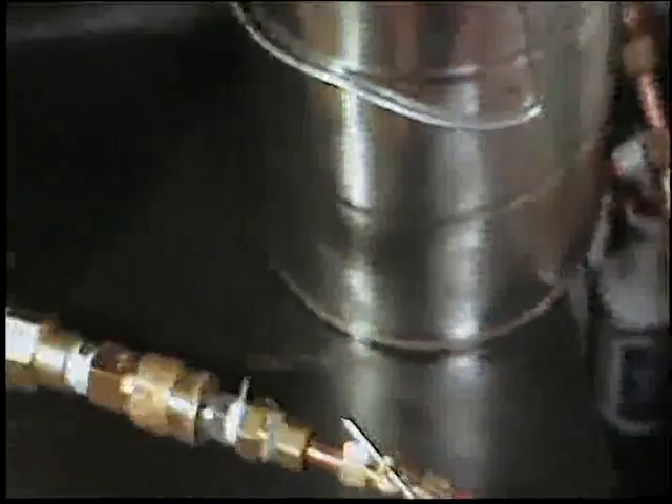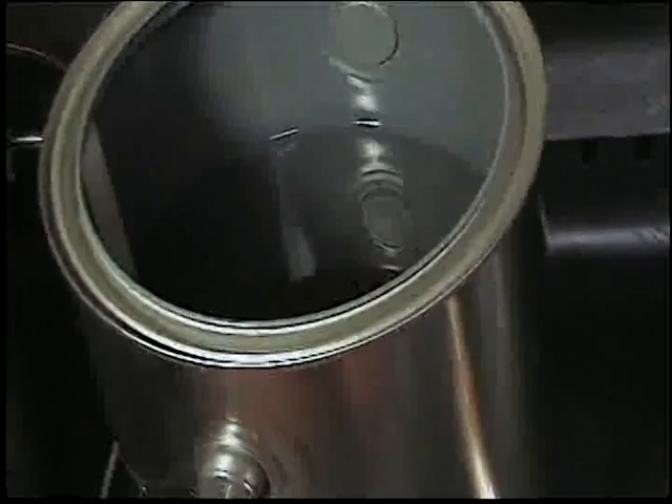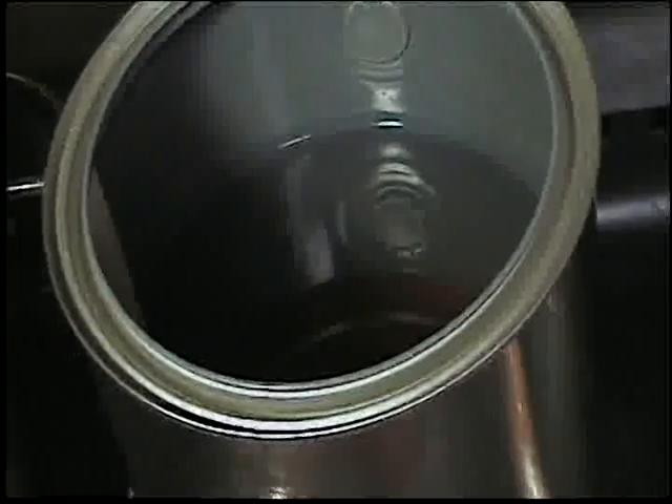This is the pellet stove and corn stove burning waste vegetable oil. We're now using a burner that runs a lot cleaner and needs a lot less maintenance. It uses a steam coil — basically just a quarter-inch copper coil, about 15 feet including a stretch of tubing that comes out of the stove, pinched in the door. It runs up and has a little valve as well as a quick disconnect. There's also a one-gallon paint can filled with water — it starts cold but stays warm on top of the stove.